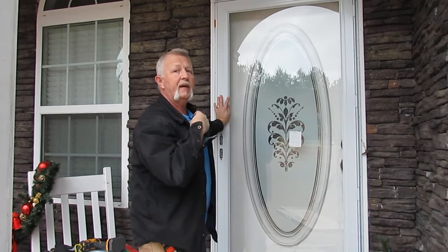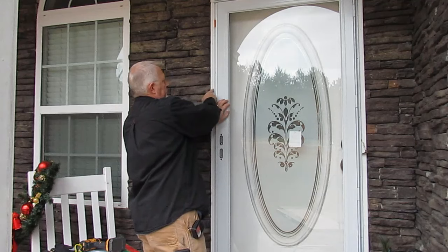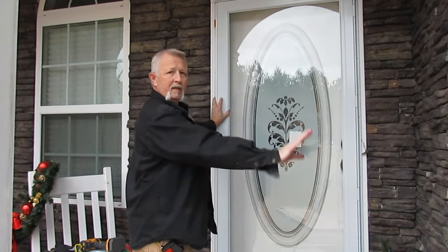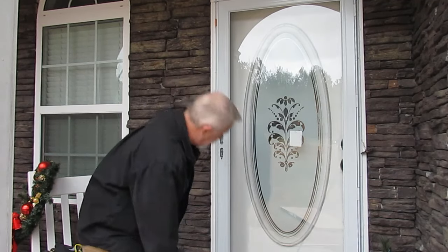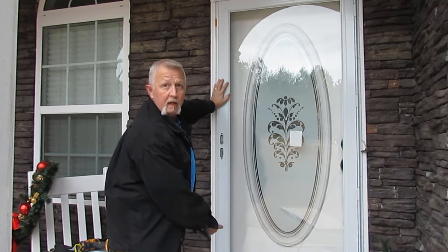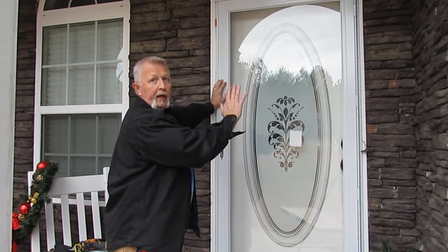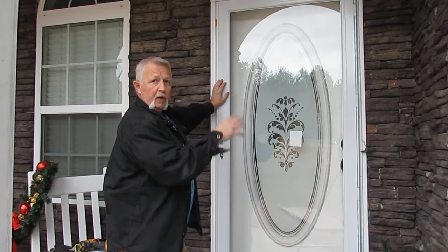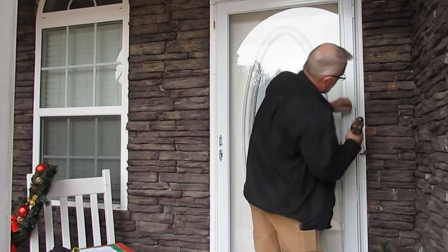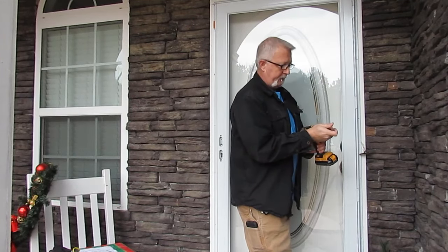At this stage you want to make sure the storm door is centered. You can tell by looking at the brick mold on each side of the frame and making sure you've got the same amount on each side — that'll tell you the storm door is centered in the door because you don't want it to be cockeyed; it might bind up or just won't sit right. You also want to make sure the storm door is sitting on that orange block. You can slide the orange spacer at the bottom to the middle to balance the door, or shim it up from the bottom to hold it flat so you can get your holes right where you want them. Count down three holes and drill this side first.